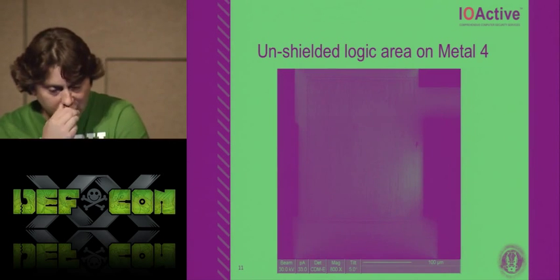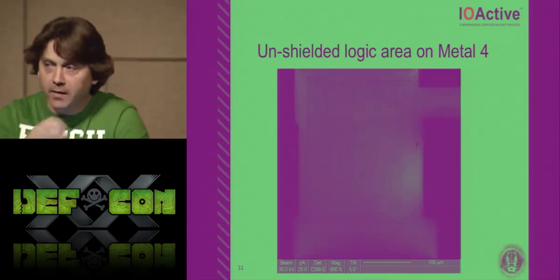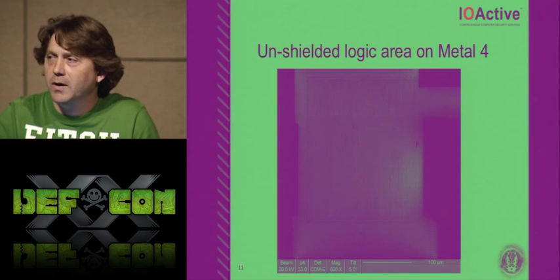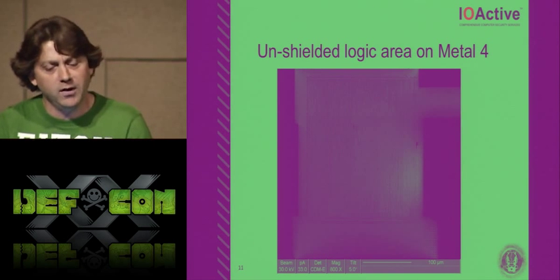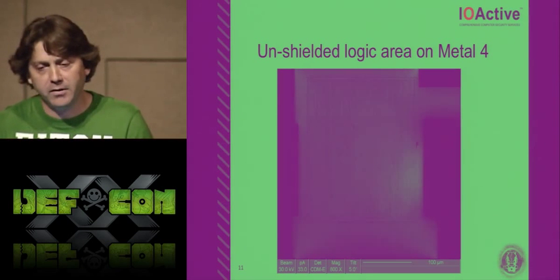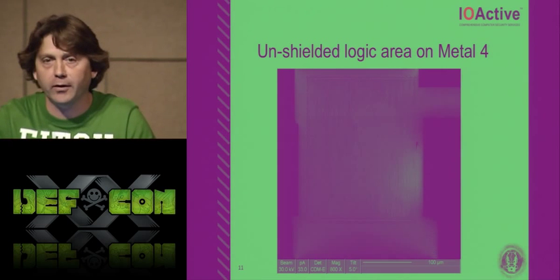That small section you can see in this picture from the FIB. So I went in on, does everybody know what a focused ion beam workstation is? It's a machine that's, kind of, a nuclear weapon to a terrorist. This machine will let me deposit metals, deposit insulator, mill away material, and so forth. So I can totally change the behavior of circuits.